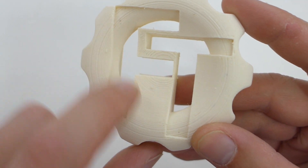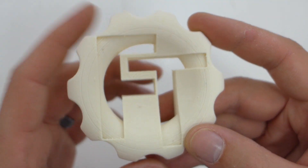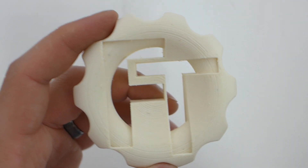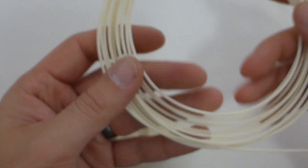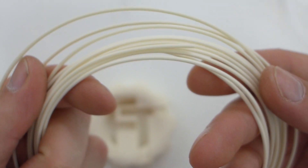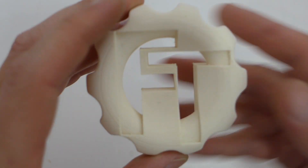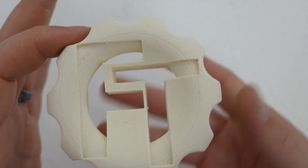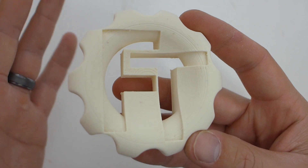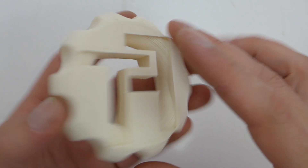There were a few color dots inside the natural filament — I'm not sure if that's common or maybe just dirt on that piece. I printed this at 225°C with the build plate at 80°C. The glue stick held on just fine, no issues whatsoever. This was printed on the FT5.